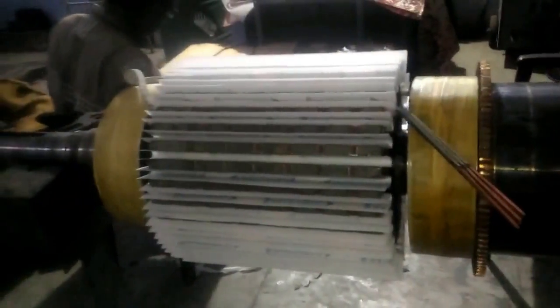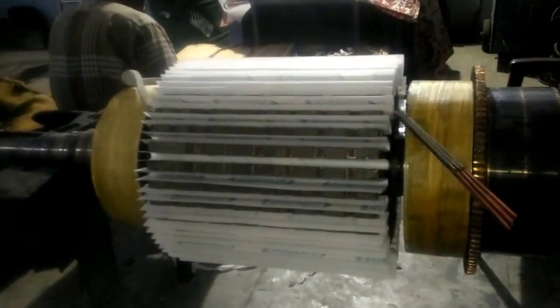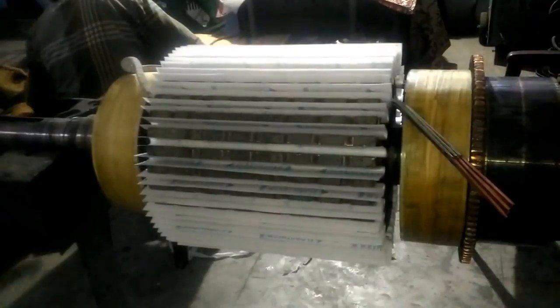Shaping is the main part, then binding the conductors, and then placing the conductors is the next part. By tomorrow we start the main movements. Once we have the coils ready, the next step is to just place the conductors in the slots, make sure the shape is comfortable, and then have the end connections placed inside the commutator. The commutator pitch is 1 to 56. Probably by tomorrow we should be able to finish placing the conductors in the slots.